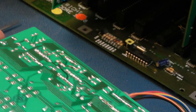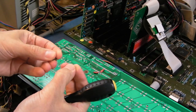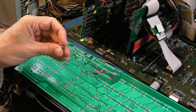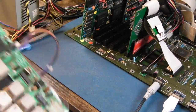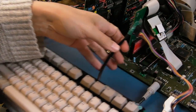So there's nothing else really I would want to do to that if this was mine. Maybe resize some of the solder points there, but you know what, it's alright. Strangely, he had the washer on the underside there, which is a bit strange. That's the way it was. I'm not going to test his other IC here, the other keyboard MCU. The chances are that it's alright.